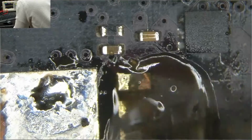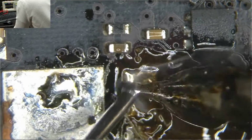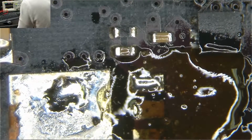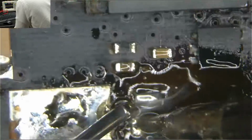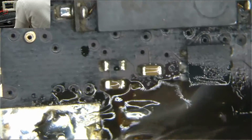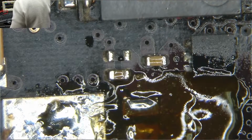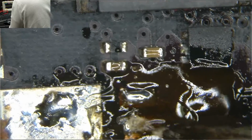But yeah, I'm going to be running wires to this. I'm not trusting those pads and these disgusting traces. See, what I'm doing is I'm trying to scratch and etch portions of the board off so that I can then put this here. So there's carbon, there's copper traces in there. I don't know if it's exactly copper, but you can actually etch away at the board and then solder on top of the etching, and then you've made yourself a kind of ghetto solder pad.